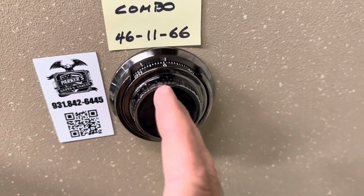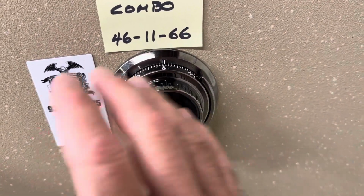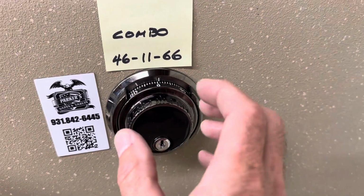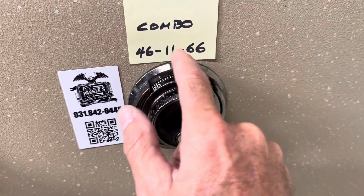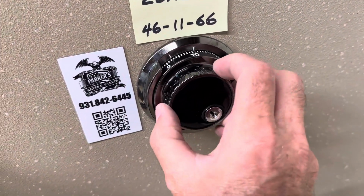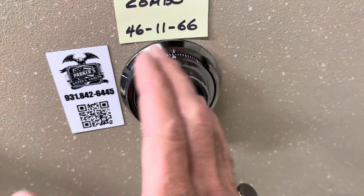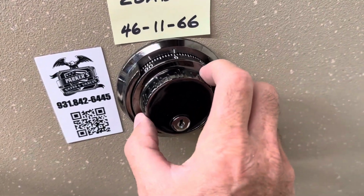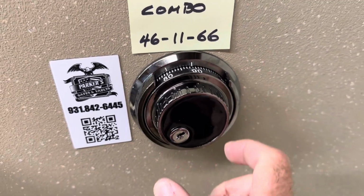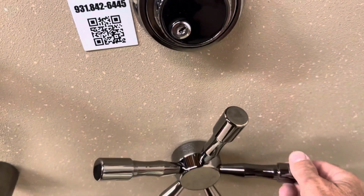And what that'll do sometimes, if it's a number or 2 off, is this: there's just little gears in there. And occasionally, especially if kids are around, they're spinning them real fast, they go back the other direction. Sometimes it'll kind of strip those gears. It usually doesn't hurt anything, but our numbers change. So if our numbers change, our combo changed, we got to do it right or find those new numbers. A way you can do that if it's only a number or 2 off is by oscillating this dial, and it'll create a little bit of slop in there, so to speak, and allow that lever arm to drop in. You should feel it pick up if it happens right around 0, and then it'll get harder to turn, and then stop just like normal, past 90 or however you want to look at that, 87 or 88, and then you'd be in, all right?